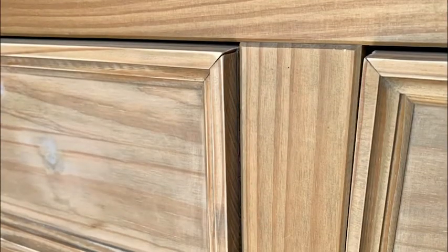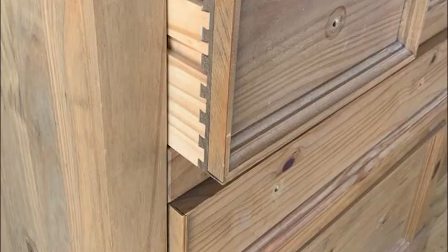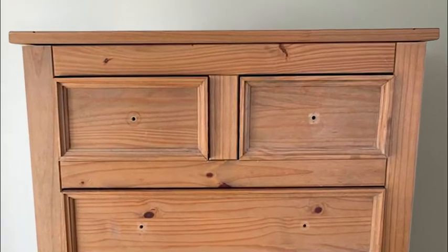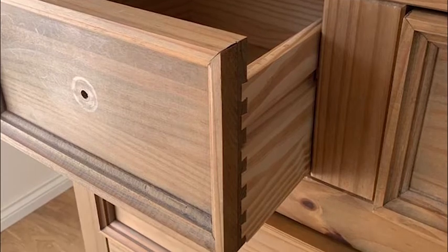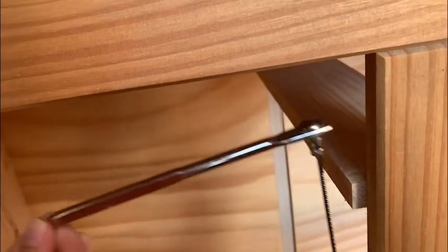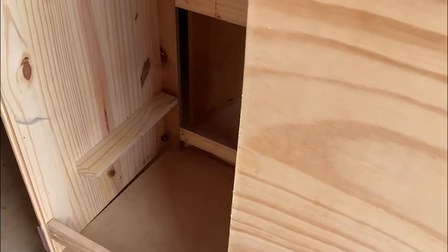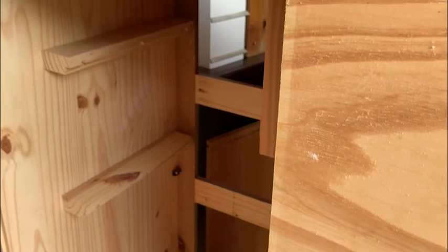On to my mystery. The two small top drawers didn't sit flush with the frame, and they stuck out by about an inch. I assumed something was caught or broken, but after an investigation it was just where the wooden runners stopped, which meant that the drawers would always stick out. So I used a coping saw to cut about an inch out of the inside runner, so the drawers lined up flush with the frame. I still don't know whether this was a manufacturing mistake or the work of a design genius who I don't understand, but I won't worry about having fixed it for the better.